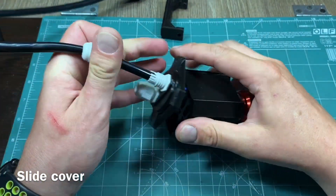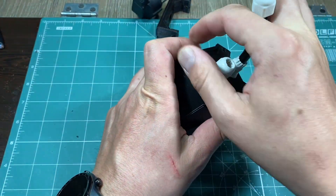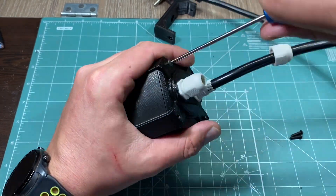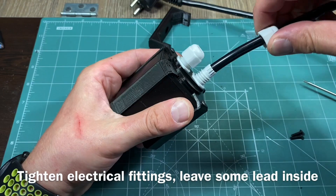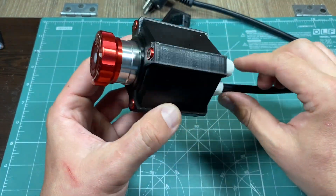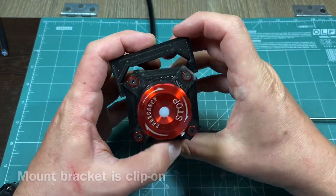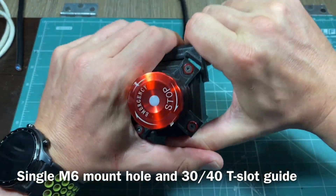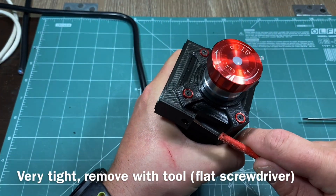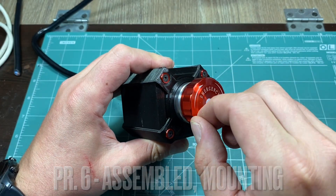Here is a short demo of how this will look in theory. Once the two cables are connected, simply slide in the back cover in place. The output cable will connect to the corresponding switch for neutral and phase line and to the Wago connector for grounding. Screw in the back cover with M3 mounting hardware, make sure you are not pulling the cable too much and still have some free lead inside the box, and close off the electrical fittings. The mounting bracket is very tight and simply clicks in place on one of the sides. It has a single M6 mounting hole and is intended to be mounted sideways on 40 or 30 series profile. To remove, simply unclip with a screwdriver.